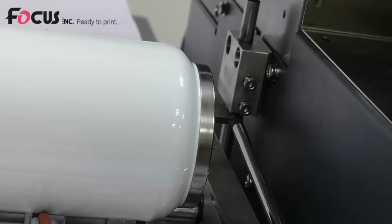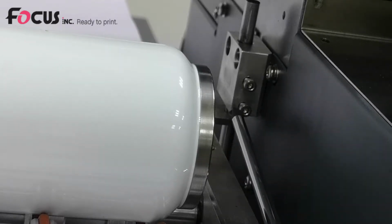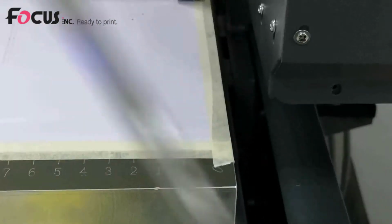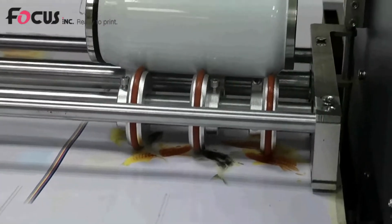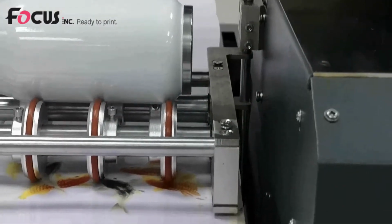Please must be careful. If this metal moves over the position while the table is still moving up, it will damage the table and the motor, the up down motor. So this is very important. Must pay more attention to the up down motion, or it will hit.